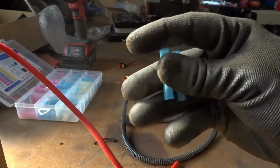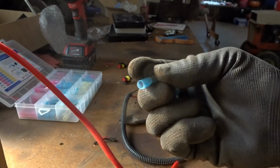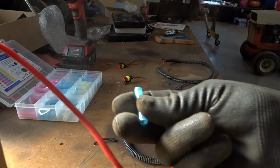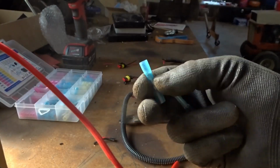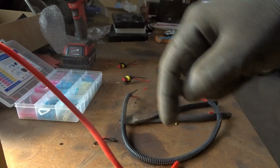So now to bring all these together, I'm just using these butt connectors. They already have heat shrink on them. I have used some of those different connectors where you heat them up, they have the solder built in, but it's not going to see salt. It's mostly undercover. I think these heat shrink butt connectors will do perfectly fine. Link also below for them in the description.